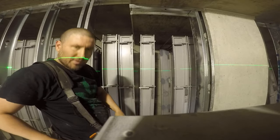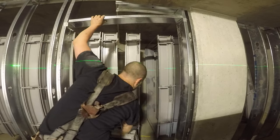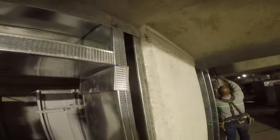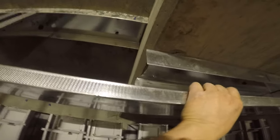The little marks on the front — see, I follow it around. That's where you can see it when you put the header in. Now you can see your mark when you're using the shoes. Otherwise if it was just on the front of the stud you wouldn't be able to see it. Clamp those in, and like I said before, measure over to mark your stud centers, fill out your header studs, and you're done — all squared over nice, screw it in.